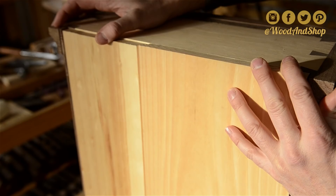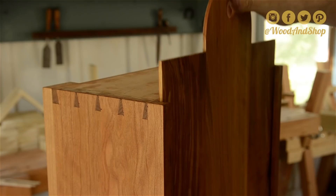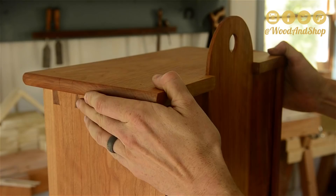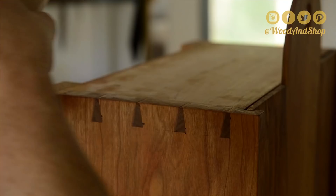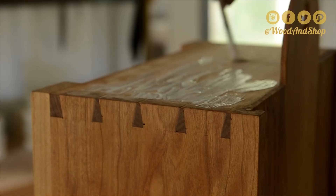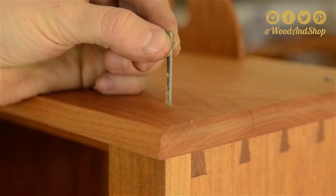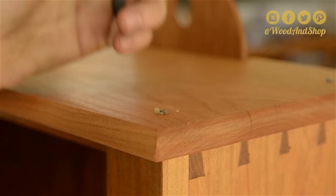For this one, I really liked the back that just slides in — the top will hold it in, and then you can hang it on a Shaker peg. Here comes the top to show you how it fits on. The top actually holds the back in. I spread glue on the top but don't get too close to the edges so it doesn't squeeze out onto the finish I already applied. Then I take cut nails, put a little wax on them, drill some pilot holes, and pound the cut nails in and set them. I make sure the long edge of the cut nails runs with the grain so it doesn't cause splitting.